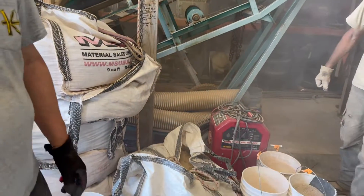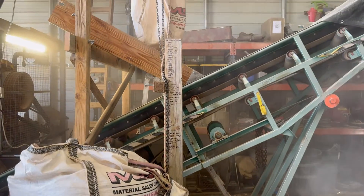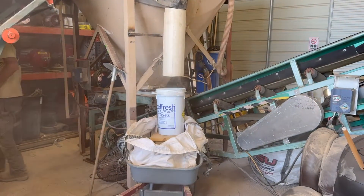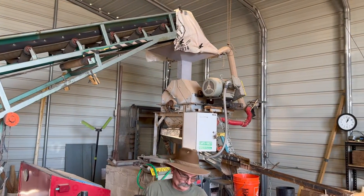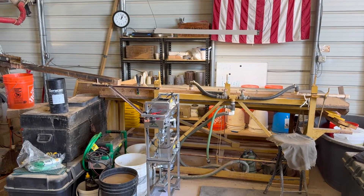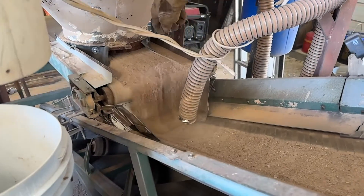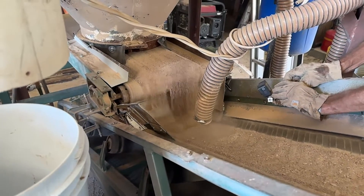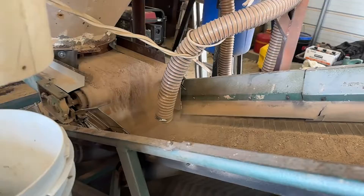These guys are taking their 250 to 300 pound sample, loading it up onto a feed hopper, which then feeds that conveyor belt. You can see the material gets lifted up and dropped into the first conveyor belt, which drops it into the big beige hopper. That controls the feed up the main conveyor, which then drops it into the crusher. They also have a little air vacuum system which just sucks up the dust out of the whole shop. People don't realize — whenever you're feeding a shaker table or any kind of separation device, a smooth, consistent feed is everything.